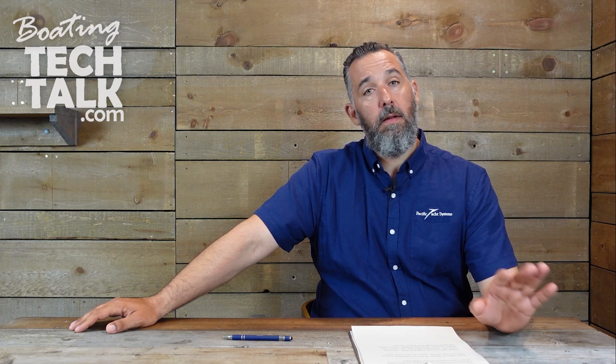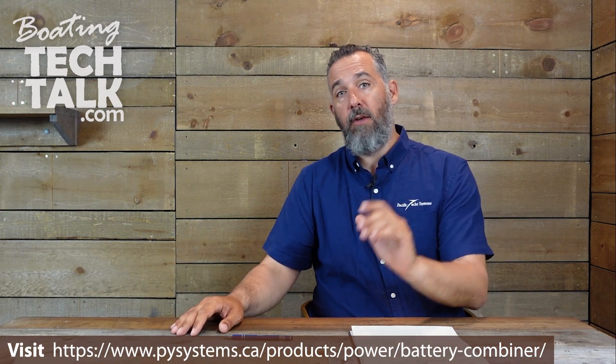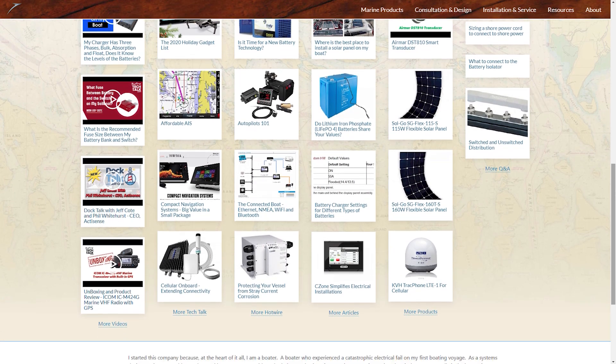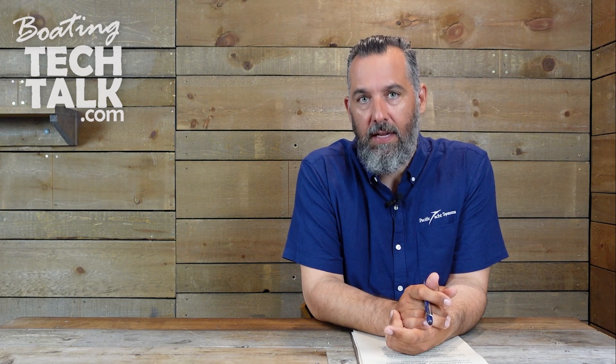He says he's seen multiple different configurations. I know there are a lot of difference of opinions on the internet, and some of the voices that are the loudest are hard to ignore. But in this instance, and if you look at our schematics — we have this conceptual diagram of the battery combiner on our website, and there's a whole section on battery combiners. My advice, 100%, is to definitely have the battery combiner always connected to the unswitched side, never to the switch side. Never on the loads, but always connect to the battery.